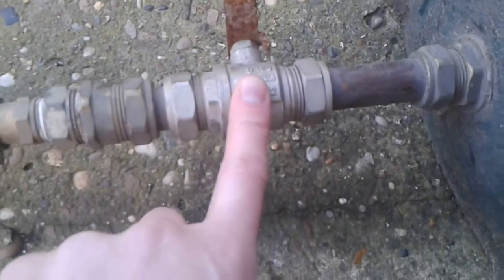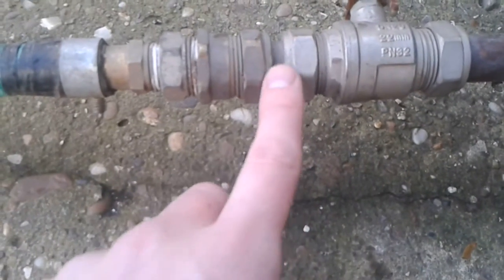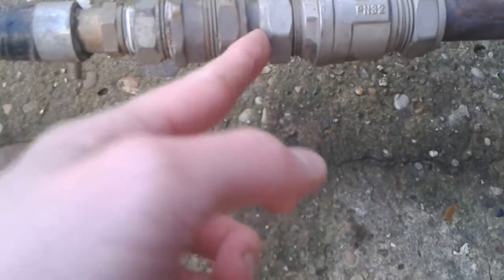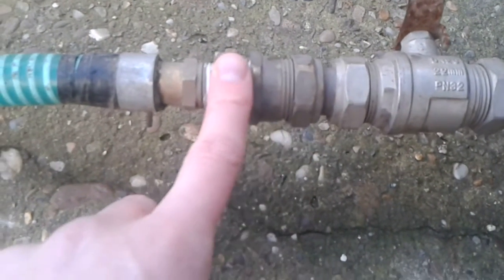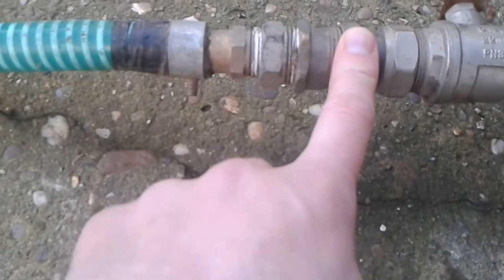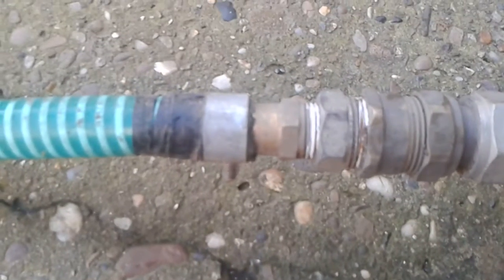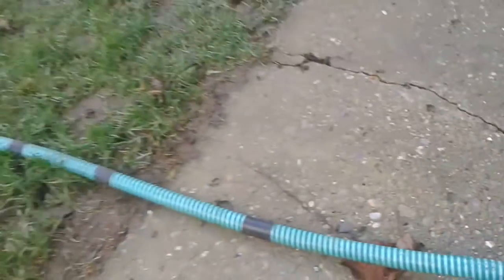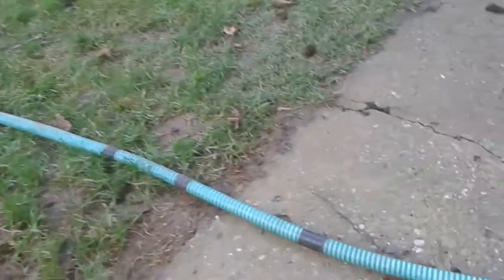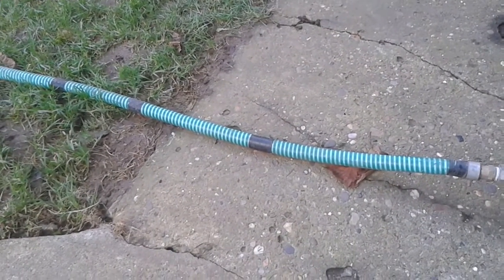Going back, we've got the gas fitting there, and then to get from this gas fitting to a three-quarter inch, you'll see there we've had to just get a series of adapters — there's a little bit of copper pipe in there, because this is olive clipped in either side, so it has to be copper pipe before you can get to your fittings. Then just a series of adapters, going from 22mm to something else to three-quarters of an inch, and then into a hose tail barb, which is then jubilee clipped on, and it comes all the way out. I've had a lot of patches on the hose there — you don't want any air coming in because it will affect your flow rates.